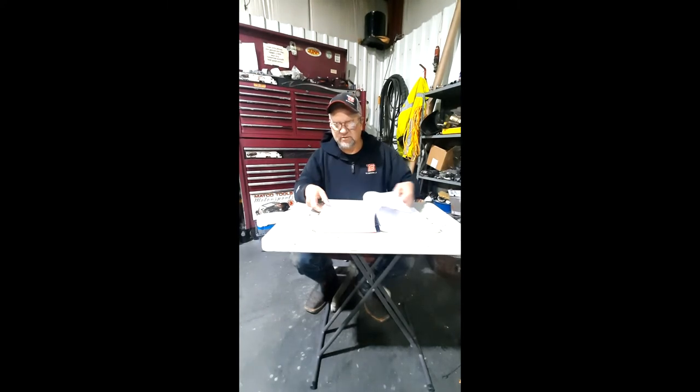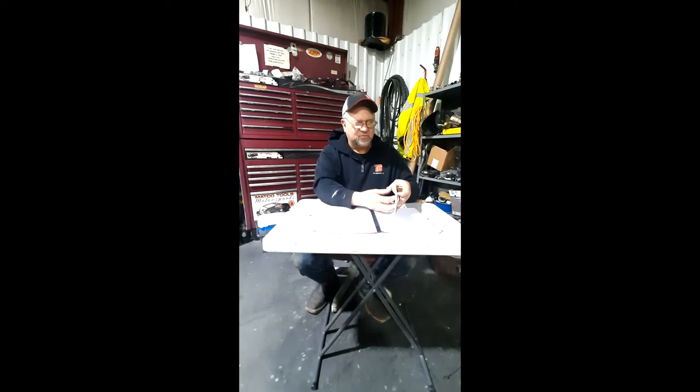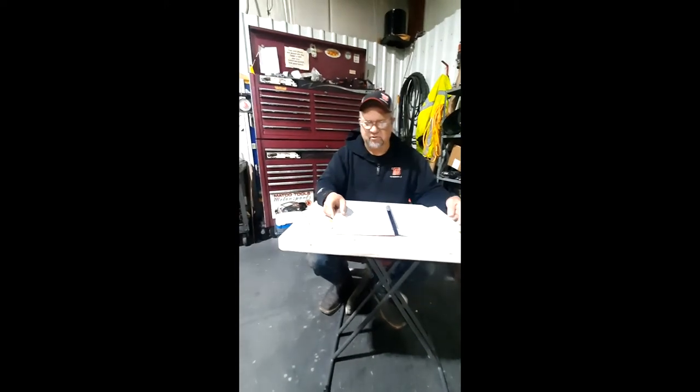Again, with the operator warnings, equipment caution, general maintenance. Now's when we come to the good stuff here. Daily maintenance. This here is a sheet for the percussion drills. On the percussion drills, a couple of the main things that you've got to do to these things. One is you've got to grease the front rotation housing every 2 percussion hours using a moly disulfide high temperature type grease. This is most important to prevent galling and failure of the rotation gears and bearings.